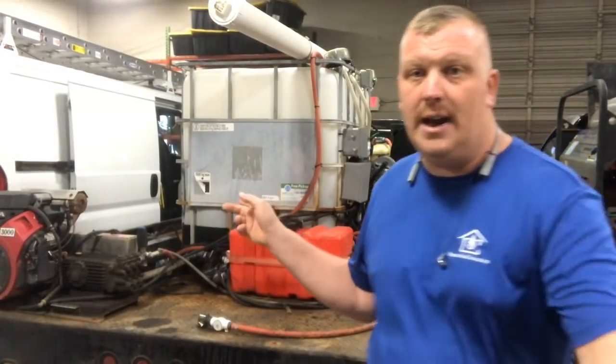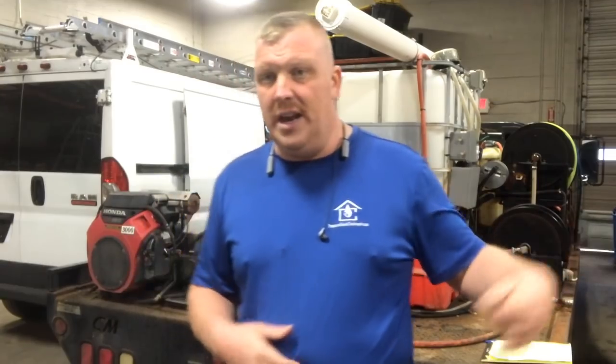Do I need a hot water unit, or can I start out with cold water? You can absolutely start out with cold water. A cold water unit is a lot cheaper. You can get a 4-gallon-a-minute for under $1,000. You can't get a hot water unit for under about $6,000. You can do a hot box setup for about $4,000 to $5,000, but an all-inclusive unit is about $6,000 — maybe $5,500 if you're lucky. We used cold water with two trucks and it worked fine. We never had a problem with it.